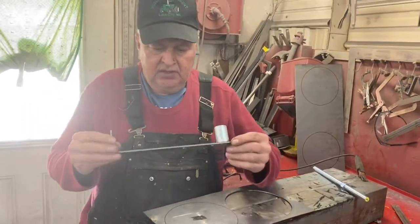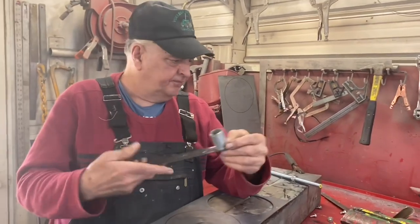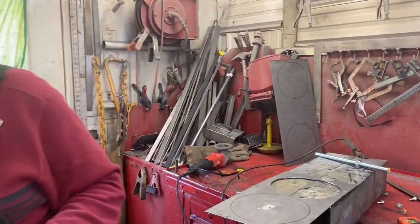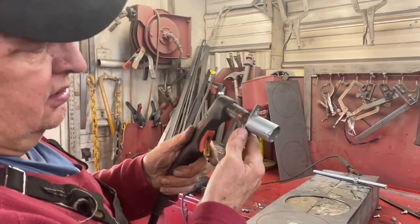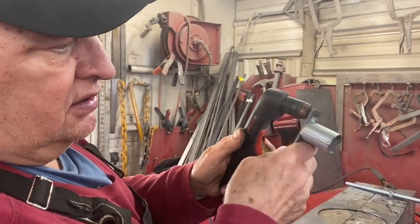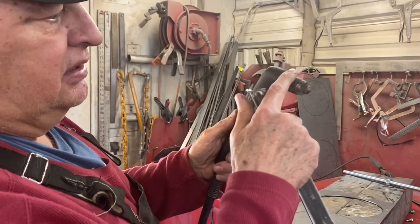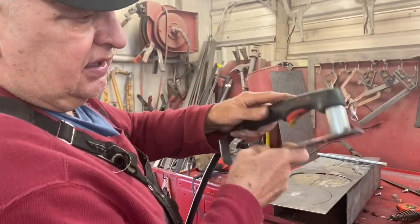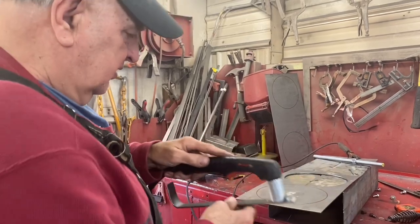What they showed on the internet was: take a piece of one-inch or inch-and-a-quarter flat stock, get your plasma cutter tip, and drill a little hole in it the diameter of the tip of your plasma cutter, then countersink it so it fits down in there just about touching but not quite. Then take a piece of tubing — these are going to be maybe different sizes — and that'll set right in there with maybe a sixteenth of an inch from touching the bottom. I tack welded that on.